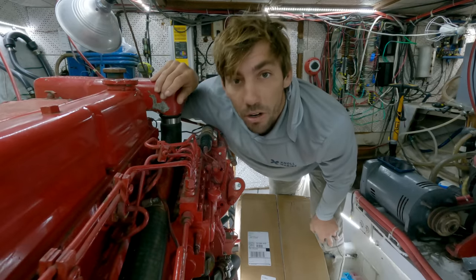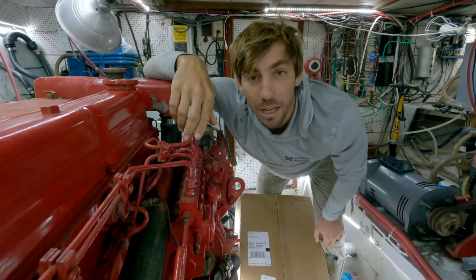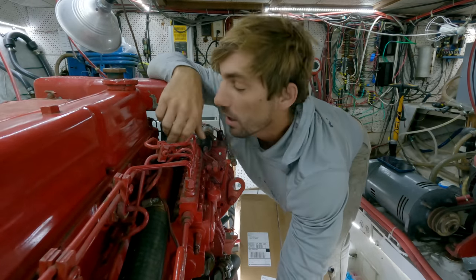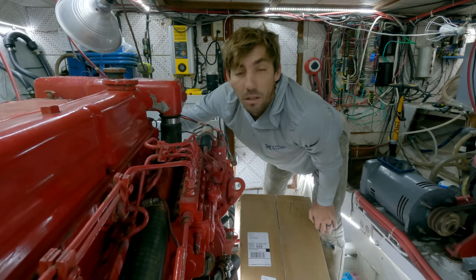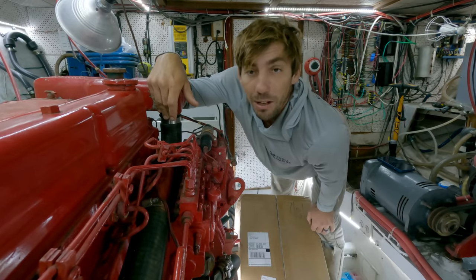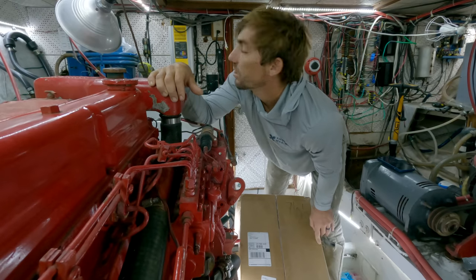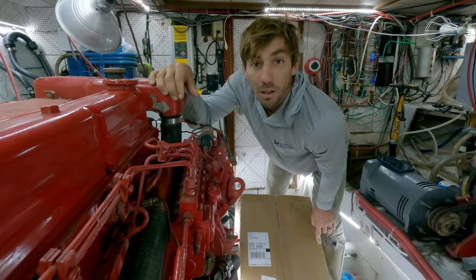Cleaning up all the old wires, just trying to get rid of all the wires that don't lead anywhere and cleaning up some of the corroded connections. Just organizing a bit. I got rid of an old battery platform that was just completely rotting away and we'll probably modify the one on this side as well. Basically just getting ready to install our Dakota lithium house batteries. We also have a bunch of Victron components that we're going to install — mounting some of the Victron components, getting them in place, making sure there's room for the wires to enter and exit, and just getting organized.